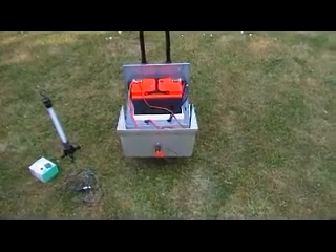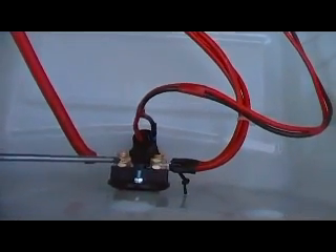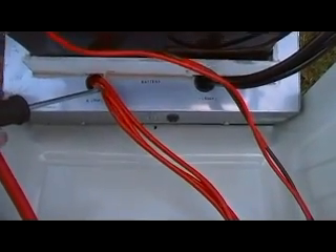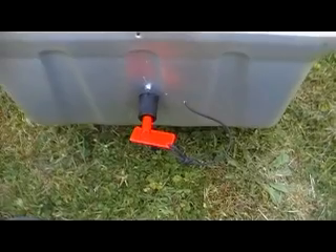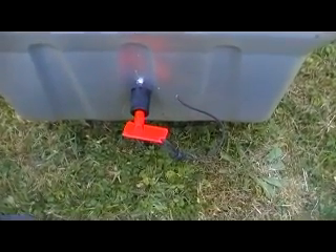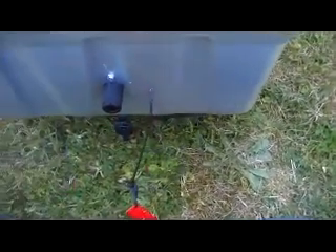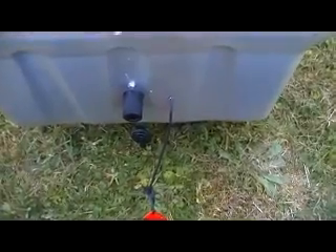Now the power trolley is open, you can see the wiring I've done inside. Very simply, a standard isolator switch interrupting the live positive feed — from the positive terminal on the battery, into the isolator switch, and then out the other side into the thousand watt inverter. Once fully charged, my intention is to switch the isolator off so it can't drain by itself. The isolator key comes completely out; I've put it on a piece of cord attached to the unit so I can't lose it.